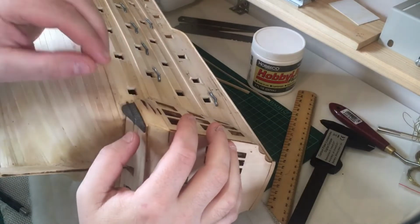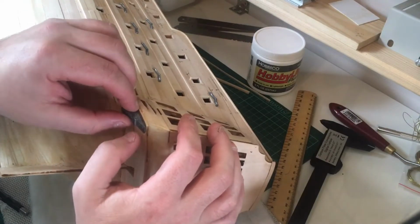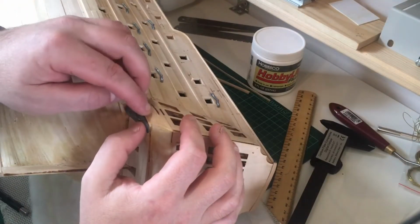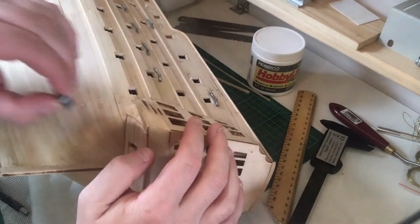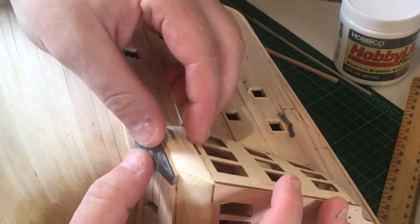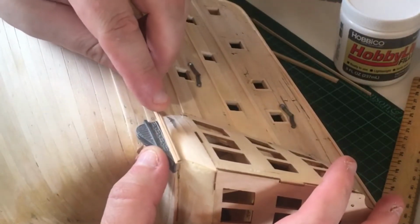Okay, because I'm having my casting slightly raised so they're in line with the new transom, I just used a little piece of 1.5 by 6 and then just traced it around the outline of the casting, and now I'll do the same on the starboard side. So I'll just put the moulded casting back on. As you can see, it pretty much all runs in line like how it would have done before. So now, once in, this is where the moulding will sit.